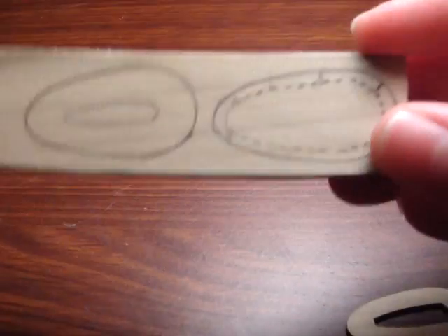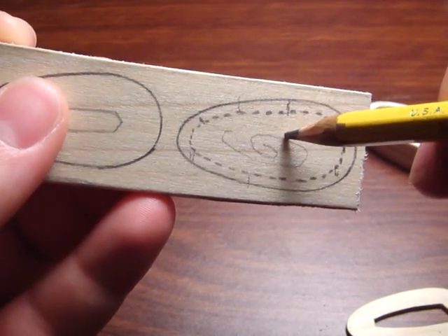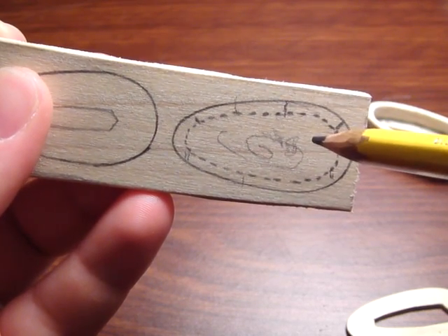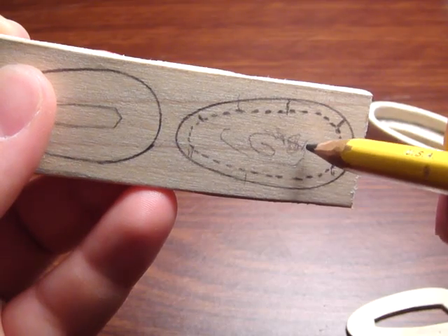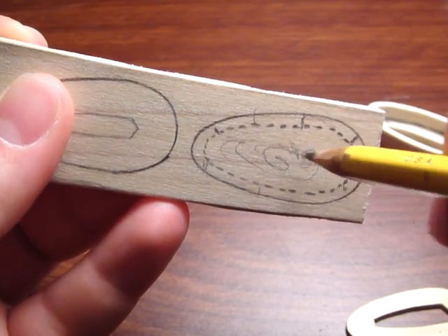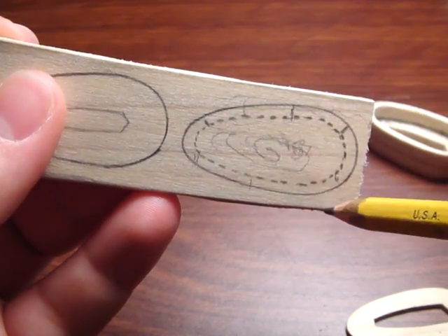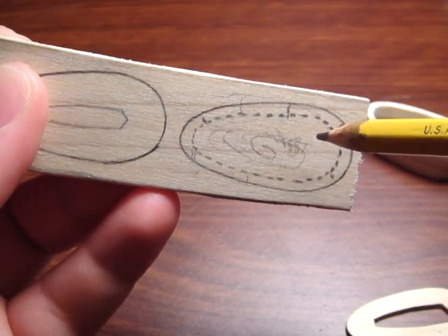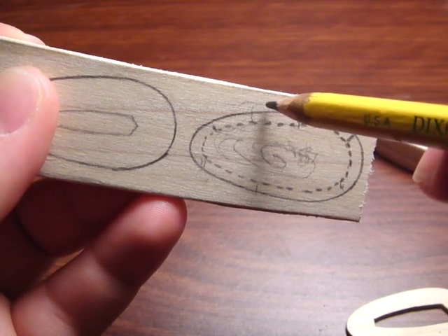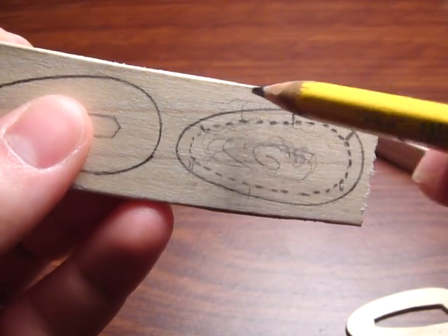When making this piece you can either carve out the inside, which is what I did and just takes a little bit longer, or you can drill a hole with a hand drill or power drill, then take a coping saw blade, stick it through, and cut it out that way. If you do the cutout instead of carving, make sure you don't cut the outside piece off yet — you need something to hold onto, and you don't want it to be fragile with the saw. When carving the outside there's less force, so less chance of breaking. Cut the inside first, then worry about the outside.